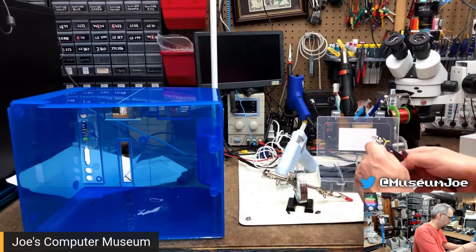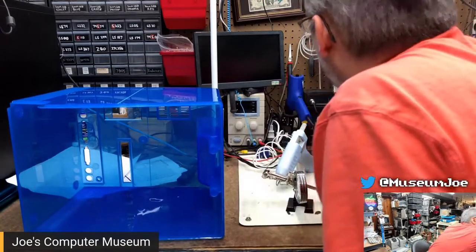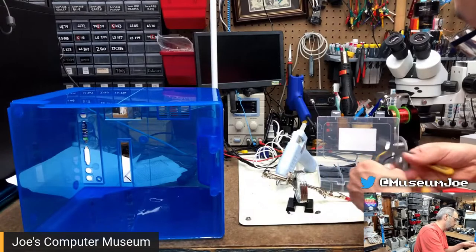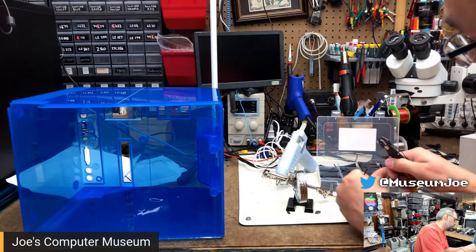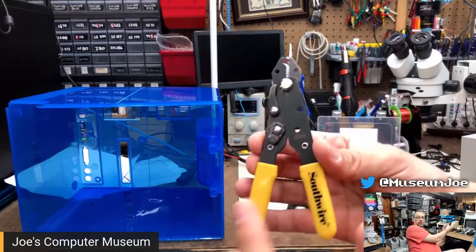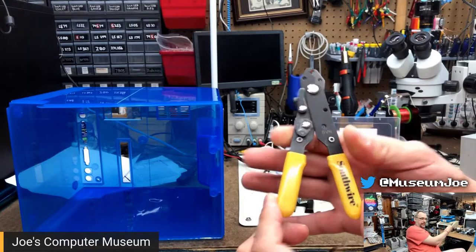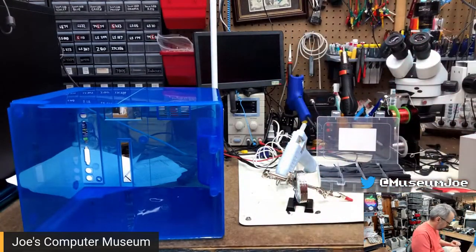This is approximately an 18 gauge wire, so we're going to put it on there. Strip that off. Strip that off. These are called V-cut strippers. They have an adjustment, and they strip anything, anytime, anywhere, fast and easy. They are my favorite type of stripper. You know, yep, there's a joke there somewhere. Anyway, moving on. So then these we also pre-tin.